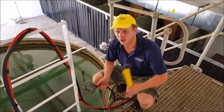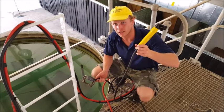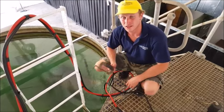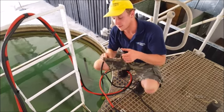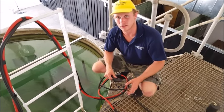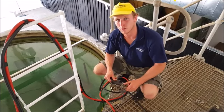From the knife switch, you run into double insulated HOFR cables — 50mm squared. From there, we run to the stinger. The stinger goes into the water; as it is fully insulated, you will not receive a shock. Over here we have the earth clamp — always try to make it easy fitting and easy removal. Remember, underwater manual dexterity gets influenced quite a lot by the coldness of the water, the thickness of your gloves, and the movement of the water.